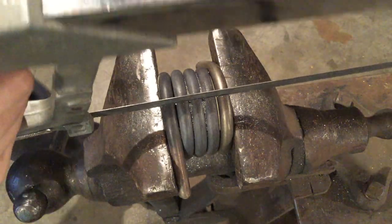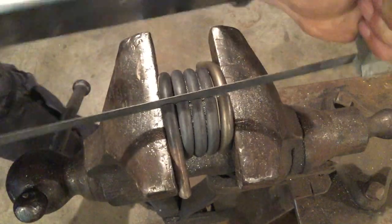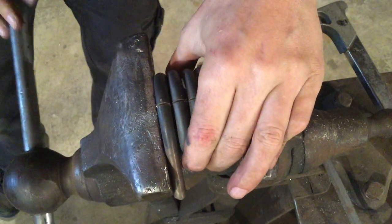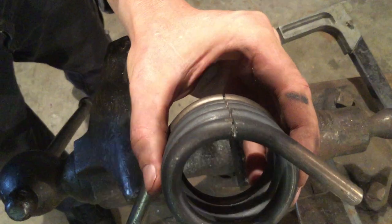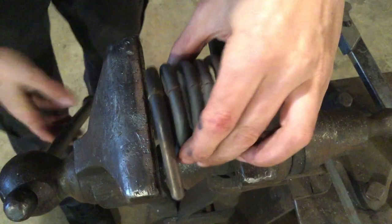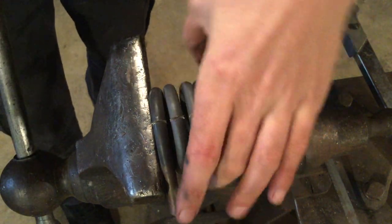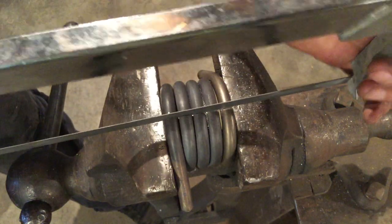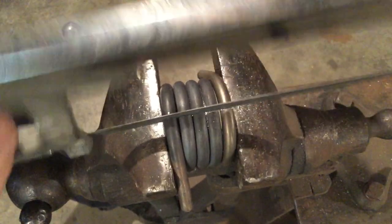We're at probably the halfway point. I'm going to change my angles to get that first pin loose. At this point I'm going to unclamp it. You can see right here we're nearly through, and on the backside there's a significantly larger amount of material to be cut through. You want to bring it back into full compression the same way you had before — tag down both straight sections. Generally you do not want to unclamp your work mid-process because it can affect the alignment of your cut, but that's the only way to really show you what's happening.